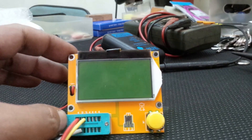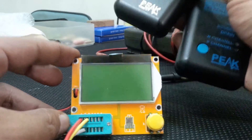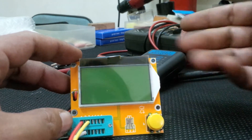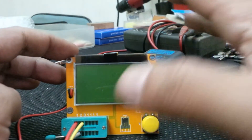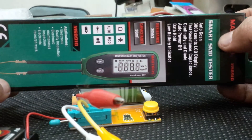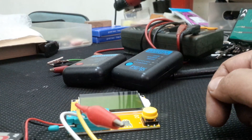With analog multimeters, sometimes you measure DC with the leads in the wrong orientation and the needle goes the wrong way, accidentally damaging the meter. For component checking, I'd recommend this tester instead. The Peak Electronics units are a regret at their price — they served their purpose but will end up in my vintage unused bin. From now I'll use this, and may consider a $10-$20 upgraded variant. In the next video I'll review the Mastech smart tweezer, also bought cheaply from eBay. Thanks for watching — please comment below, bye!